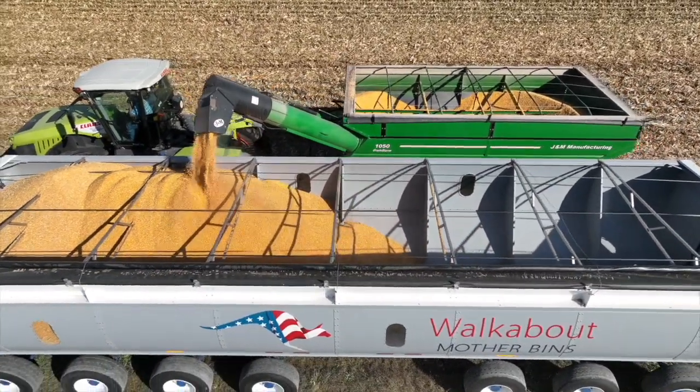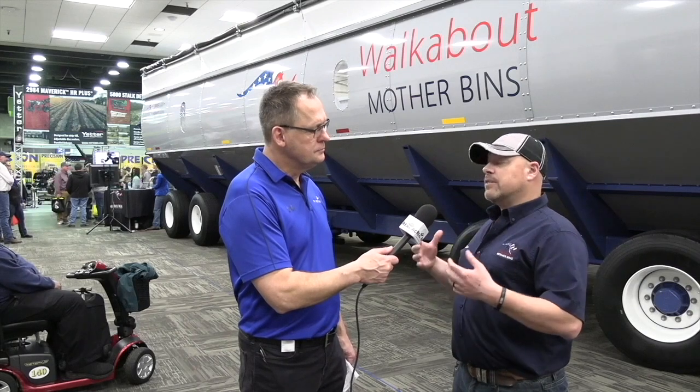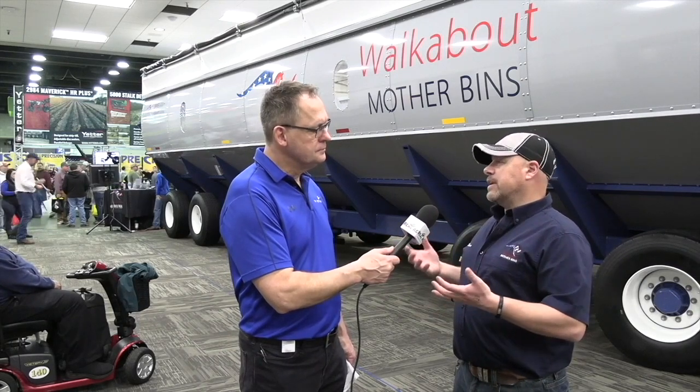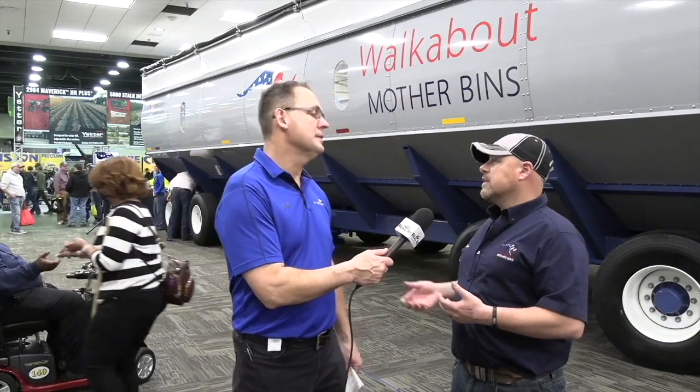This is a big green cart — how much power do you need to move it? Let's make sure we get the concept correct: it's not a grain cart, it's portable storage, and it works in tandem with your grain cart. It sits on the end of the field, and for that reason you only need — we recommend a 250 to 300 horsepower tractor to tow it, because you're only ever moving it empty. It does have the ability to move partially loaded in the field to shorten your grain cart cycle or change approaches for your trucks, but never on the road.